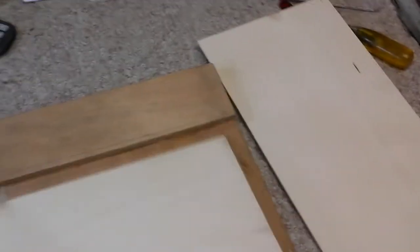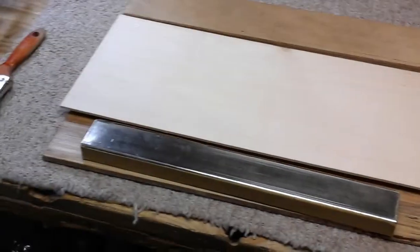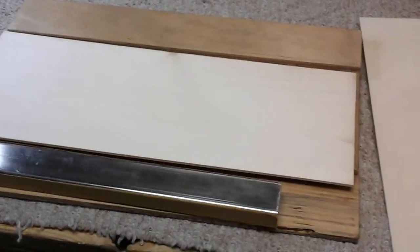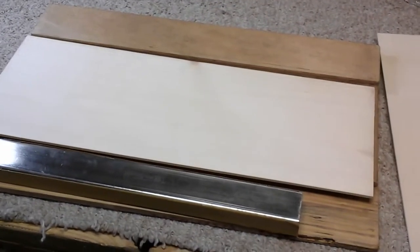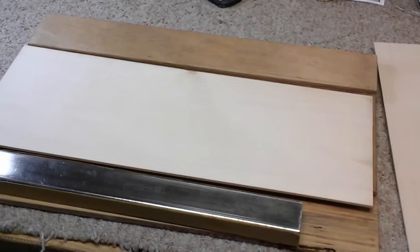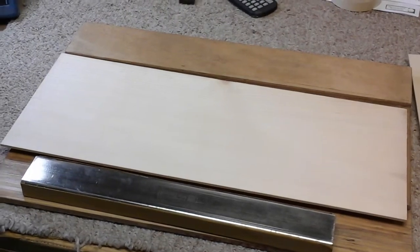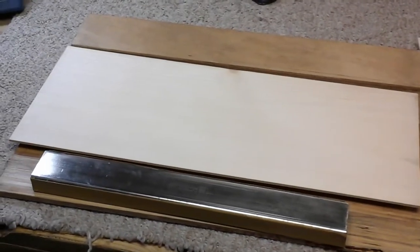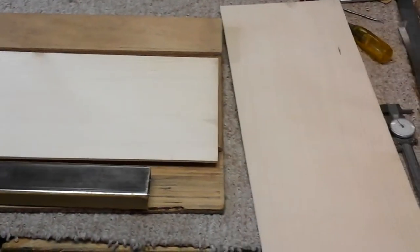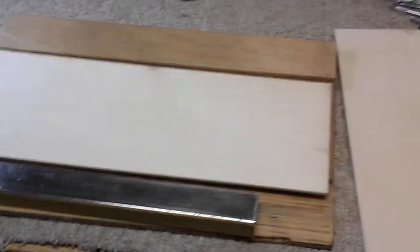This jig that you see it's laying on has sandpaper on it, and you use it to straighten out the seam there. Then you glue and join the two pieces together and you get a pretty tight seam so it will hold. Trees aren't really big enough to be one piece for a guitar, so you have to do two bookmatched pieces to make a top, and it goes that way for the back rather.